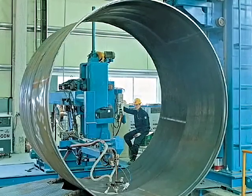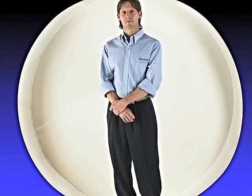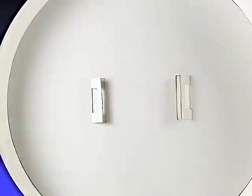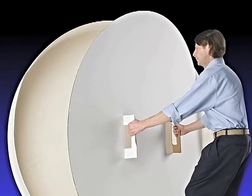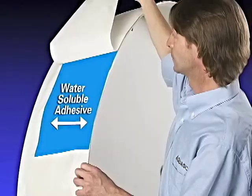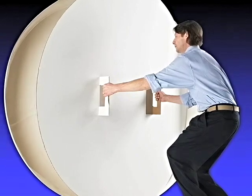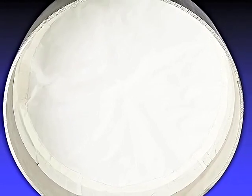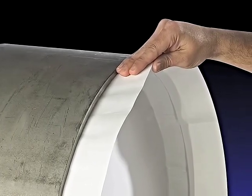For large bore pipes, the process is just as simple. To install an EZ Purge sized 56 inches or greater, remove cardboard cross support pieces and set aside for future use. Unfold handles from the specially designed cardboard installation disk. Carefully lift the EZ Purge from the carton. Peel one section of release liner, exposing the adhesive. Using the cardboard handles, insert EZ Purge into the desired location inside the pipe, a recommended minimum distance of 24 to 36 inches from the root gap. Align EZ Purge atop the pipe by pressing the exposed portion against the pipe and secure in place.